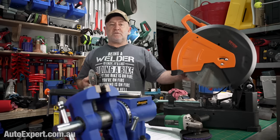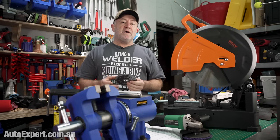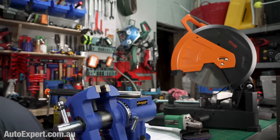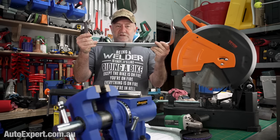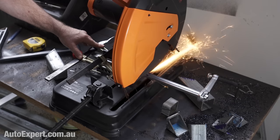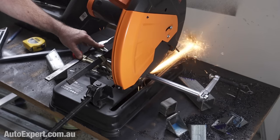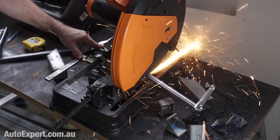This brings me to an important point with this saw: don't cut anything hard with a TCT chop saw — it's only designed for structural grade steel. I had a job cutting down some clamps whose shanks are quite hard, and I used the abrasive chop saw for that because I'd just be feeding it new blades with the TCT saw, which defeats the purpose since the blades are expensive. So abrasives — either an angle grinder or an abrasive chop saw — are fantastic for cutting things harder than structural steel.